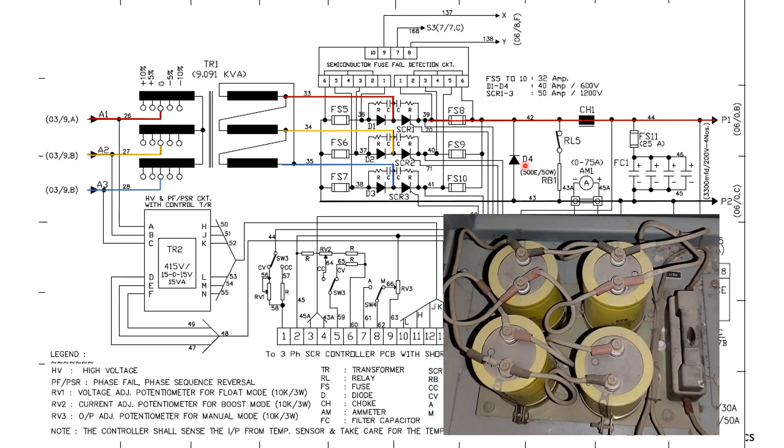After that we have a circuit for removing ripples — this is the filter circuit having four capacitors and a fuse. After rectification, the DC will have some amount of ripples; using this filter circuit all the ripples will be removed and pure DC will be obtained. Then we have diode D4, which is the protection diode. This will protect the circuit if there is any change in the supply or if there is a reverse supply by mistake. After that we have P1 and P2, moving on to sheet number 6.